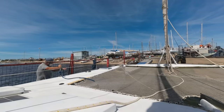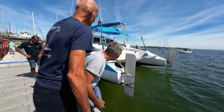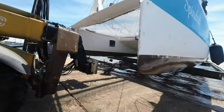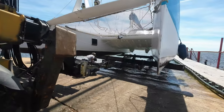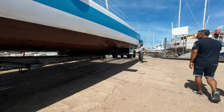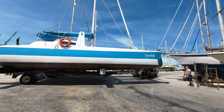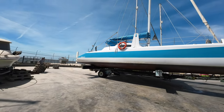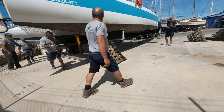we're also going to repair a few places in the hulls, where one place is a little bit wet, the wood from old leakage of the water bag from the inside, and we're going to replace that with foam, epoxy, glass fiber, and maybe some carbon. And the other side, also same procedure, that was leaking from the hatch on the top from when rainwater was coming in, and we will make it nice and strong so there is no possible water making any of the wood down there wet again.